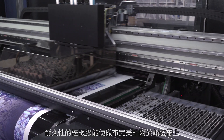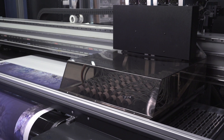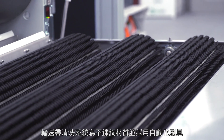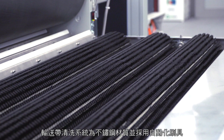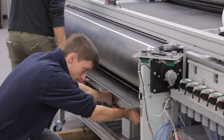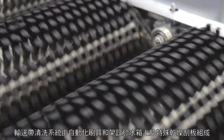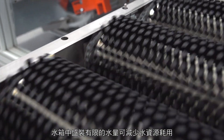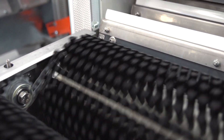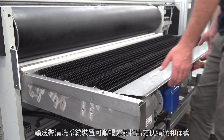The permanent adhesive coating provides perfect adherence of the fabric on the belt. The belt washing system is wholly made of stainless steel and housed under the printing plane. It consists of a motorized brush unit and special drying doctor blades mounted on a tank containing a limited quantity of water so as to reduce consumption. The device can be smoothly ejected for easy cleaning and maintenance.